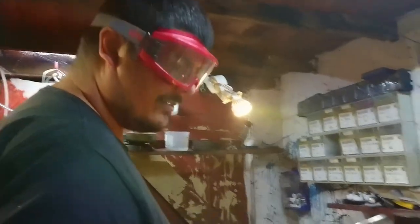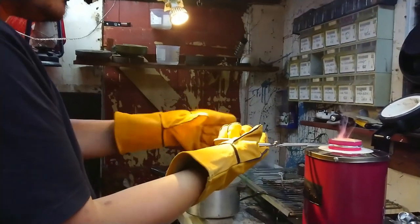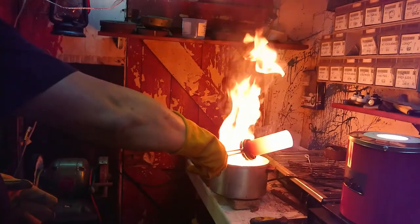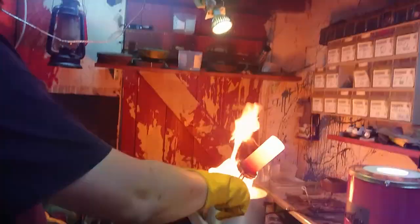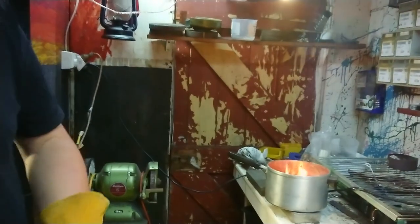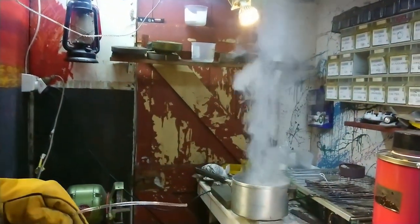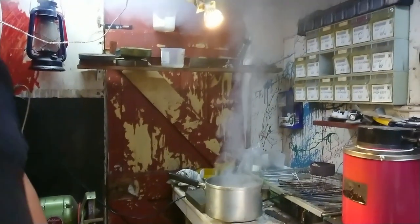I'm going to make a couple of ingots out of some of the leftover while waiting for things to cool off. I've put some more brass in plus all the slag - going into this aluminium pot, which I hope doesn't melt through. There's a bit of wax residue in there too, which we kind of expected. If it doesn't die off in a minute I might put a bit of water in there, though wax fires can sometimes make things worse with water. We'll see what quality of brass we've got. In the meantime, we're going to crack these molds open.